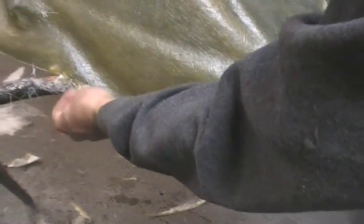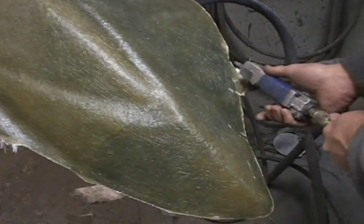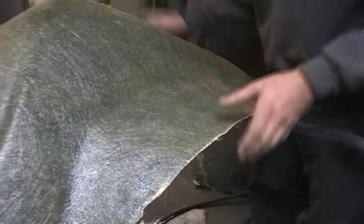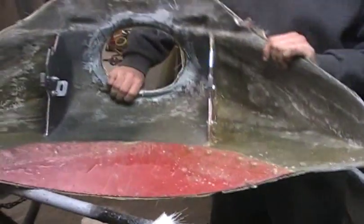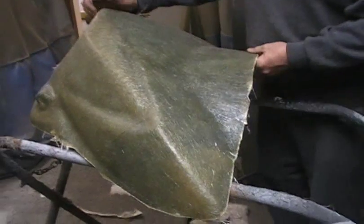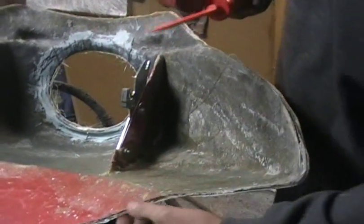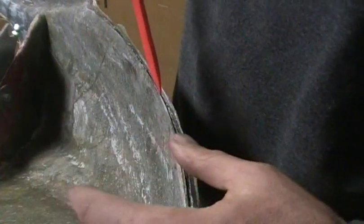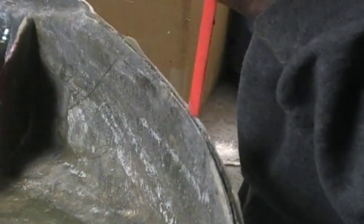That's pretty good — you don't have to be real accurate, just don't hit the mold. Now I'll cut it loose of the stand. That's basically the mold. What you see inside here is our part. We're going to clean these edges up a little bit more, then we'll show you how to pop this out of the mold. So we got it flipped over. What you want to do is find that edge right here around the whole thing — you're trying to separate this. I've got just a plastic scraper; you don't want to use anything hard or metal that will gouge the mold. You take the scraper and find the edge and just kind of work it — see it spread there?